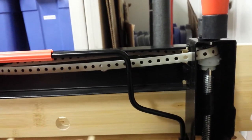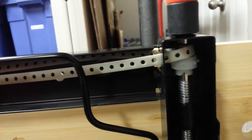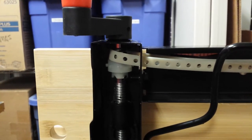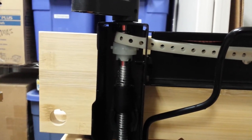The other mechanism I want to show you is this little track. I'm going to show you this on my 425 Type 6 because it shows up a little better on that bench. As you can see on this Type 6, that white perforated belt is not on those little gears — so you need to make sure it's on those gears. Follow the trail inside to make sure it's in the correct place, and make sure it sits back on those tracks on both sides. That'll allow you to crank with just one hand while you hold your work in place. Make sure that's in place and that the white belt is not damaged.